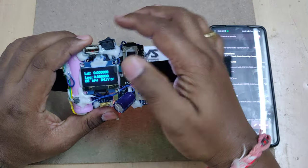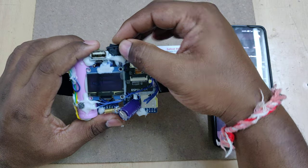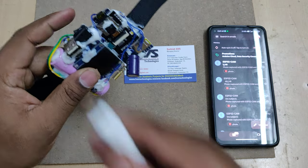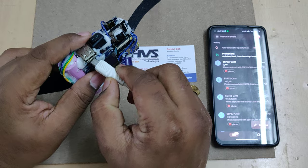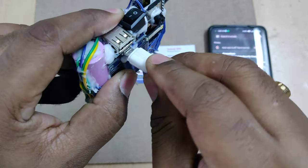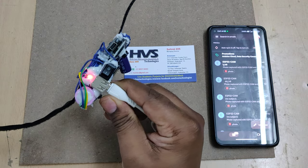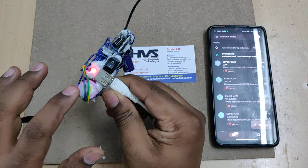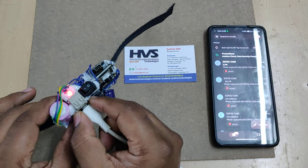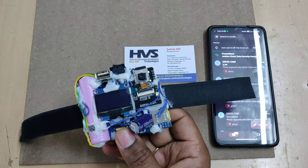The whole system is powered by a lithium-ion 3.7V 4300 mAh battery. This is the main on/off switch, and the battery is rechargeable. To recharge, connect a B-type charger to the port — connect gently, don't push hard. The LED blinking rate shows the battery is charging; once the blinking stops and the LED stays continuously on, the battery is fully charged. You can then disconnect the charger and use the device for at least one hour.